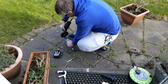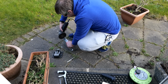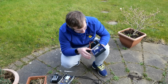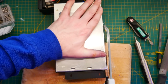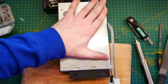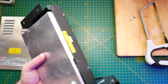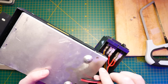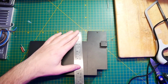I went to the website and ordered one of those Meanwell power supplies. After checking the datasheet, I knew that the PSU was not going to be a straight fit. Some modifications needed to be made. Let's start by taking out some grinding tools of your choice. I mean, you don't have to have an angle grinder. A hacksaw will work just fine because the whole case on that power supply is aluminium. But I have to say it was pure luck that after hacking off all those folded-over winglets from the power supply cover, it was a perfect fit for the existing space for the power supply.